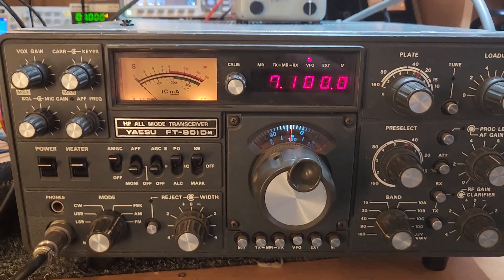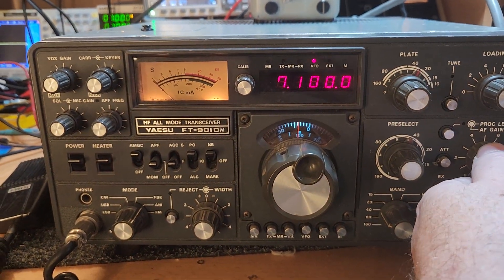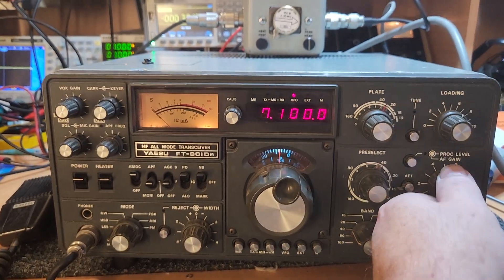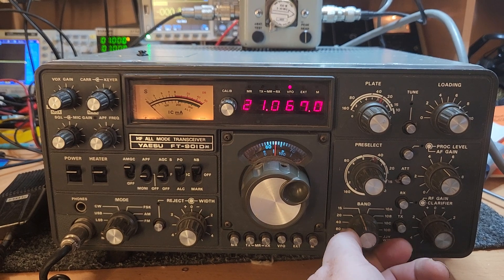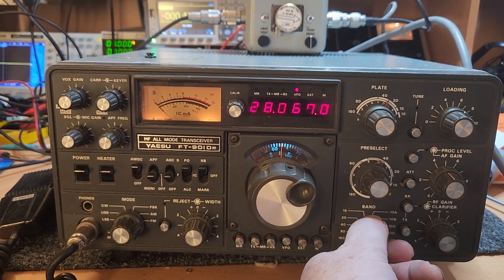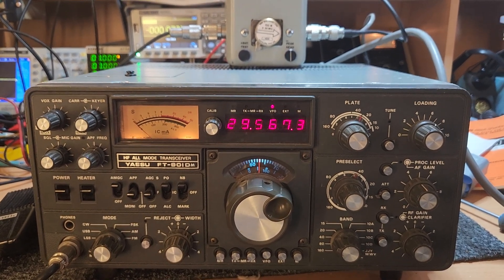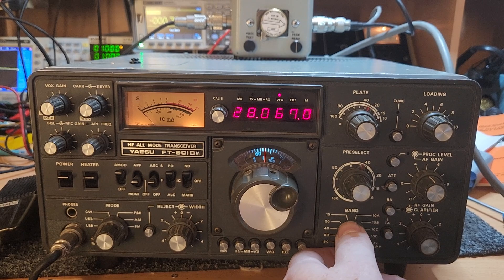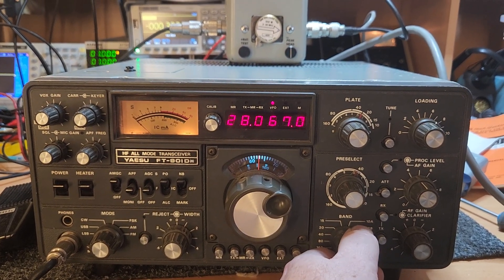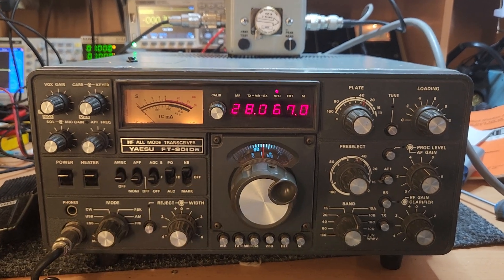For what it is, it's actually quite a novel radio. Back in tune and going into sideband. Let's just make sure all our bands are coming up on it. It's on 10A, so nobody's put any different crystals in here, which is good. That's really important on this radio because it means you can use 29 MHz FM correctly and use everything as intended. So many times we find a 10A through 10D fitted with a 41.5 MHz crystal, and suddenly it only reaches 27 MHz.